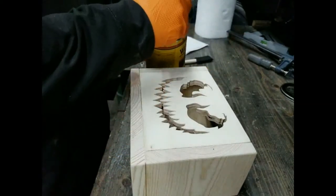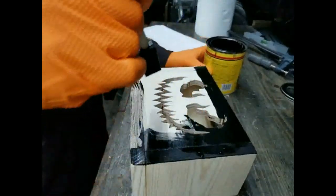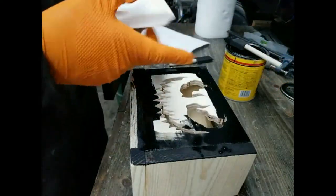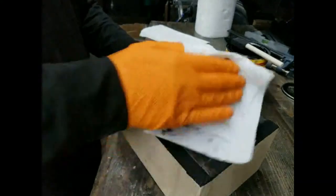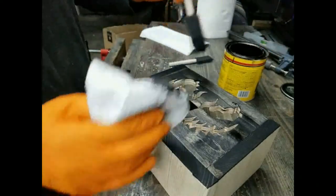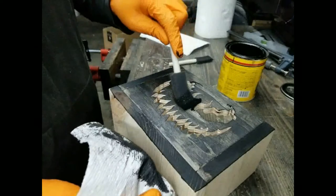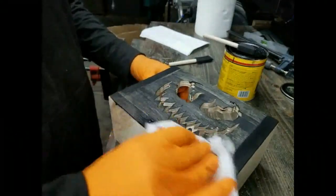And using stain, it's all about preference. You can leave it on for hours at a time, and you get the darkest shade that you can possibly get. The whole thing will be a very deep black. Or you can put it on like this. Take a rag, and you can wipe it into all those little places that you didn't hit with the brush. Just kind of hit it with a little bit more. And like I said, it's all about preference. It's all about how deep you want the color to be in what spot.